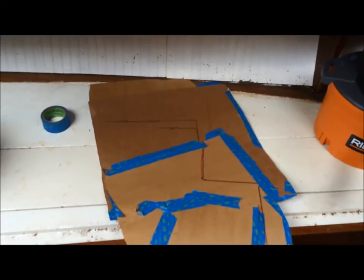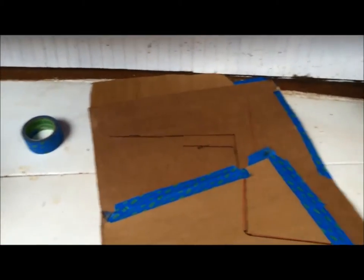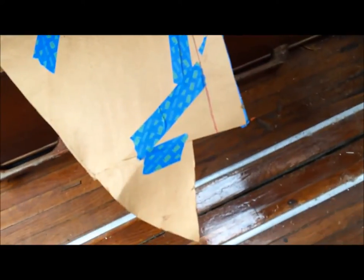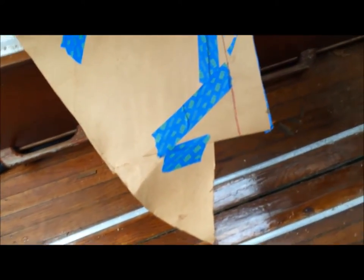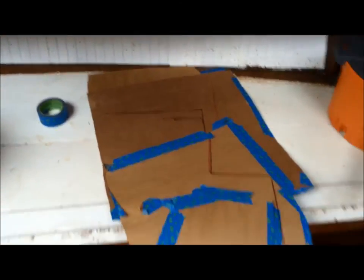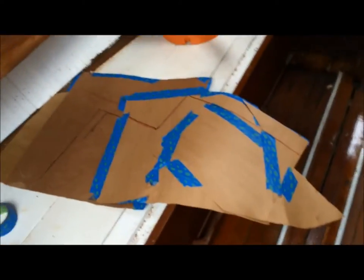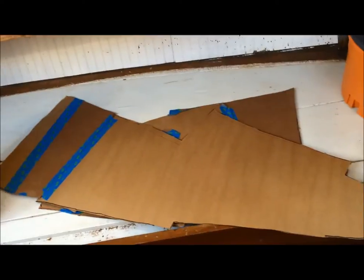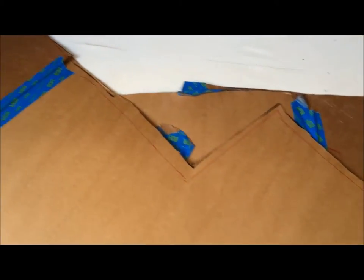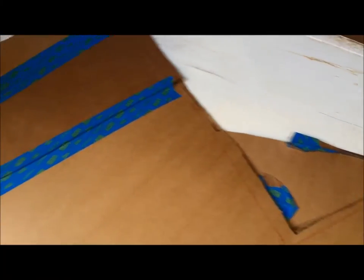As you can see, this is the back side of the template. Notice the lines. And that part is pretty true at this point. So I'll trim out along those lines and take a second fit. This is a third cut just on the construction paper. Put it back in. Try to get about a quarter inch over so that I can sand it down and get a tighter fit.